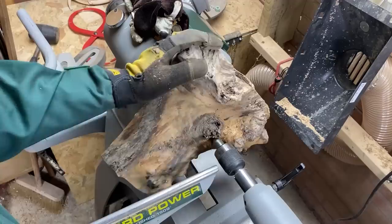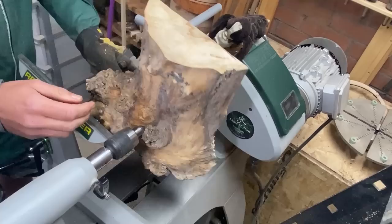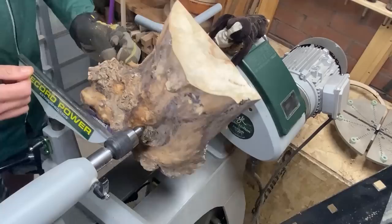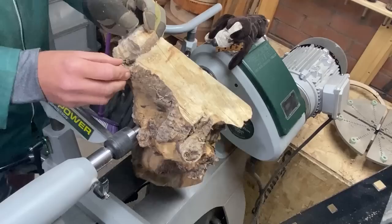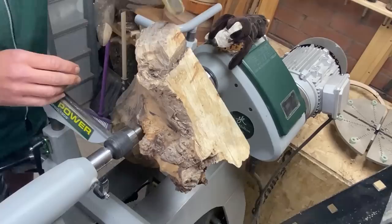Okay, we're about set up. It's not the best balanced thing I've ever seen in my entire life. When I get this mass out of here, it should hopefully improve somewhat. I don't think it'll ever get brilliant though. I'm going to be turning around 600 mark. It is going to be a shaky ride. Hooch is in for a bit of a shock, I think. I've sharpened up, face mask on, glove on, because some of the bits flying off this are going to sting a bit. We'll get started.